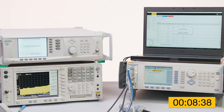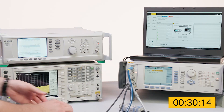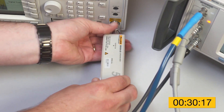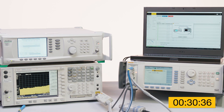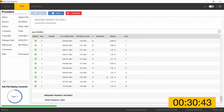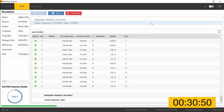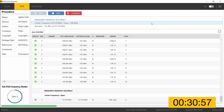MetCal is asking us to connect a Type N 50-ohm termination to the input of the UUT. Reaching across to make that connection — both of these tests are somewhat slow and will take about 25 to 30 minutes with this connection in place. Next, removing the termination and connecting the leveling head directly to the RF input. Clicking advance causes MetCal to begin taking measurements for the frequency readout accuracy test, getting through as many tests as possible before pausing for the next connection change.